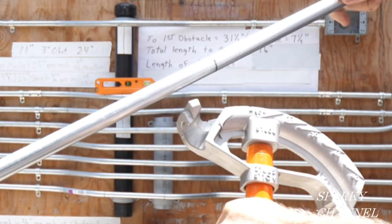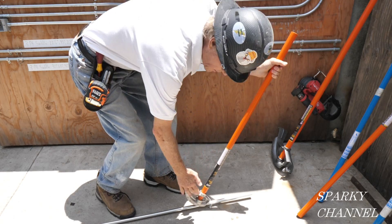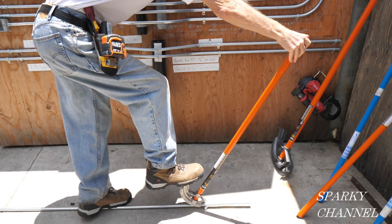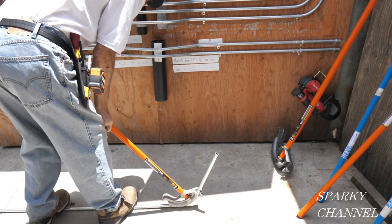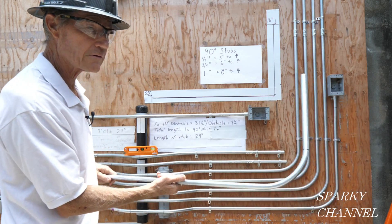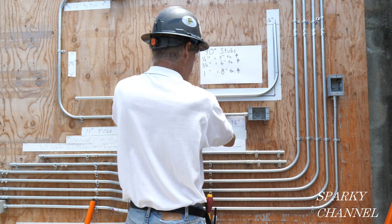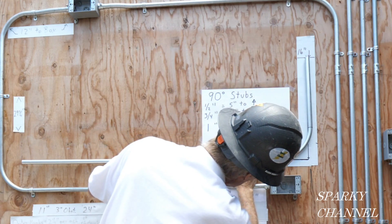Here's the arrow right here, and I'm going to put my mark right there at 11 inches. I put pressure on this the whole time so it wouldn't move — there it is at 11 inches. If you're right-handed, put your left boot on the back part of the conduit and your right boot on the heel of the bender, and just go nice and even and slow. There's your 90-degree stub. We just made it, and you can see I've got 16 inches right there — level and plumb. It's perhaps an eighth of an inch short of 16 inches, but it came out very close.